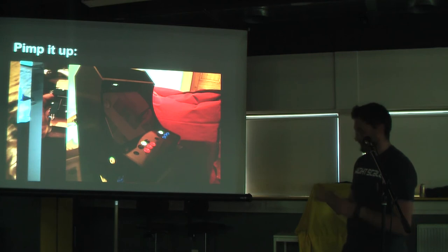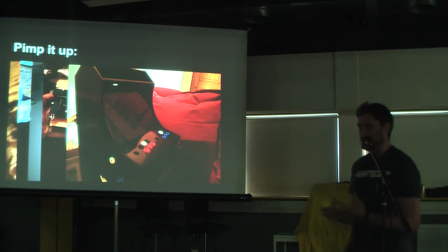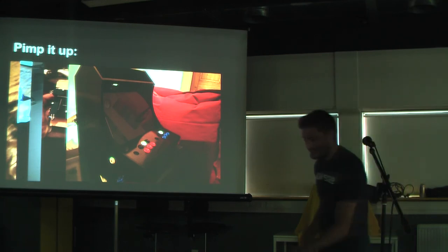I had a screen that I got off, thank you, I think, I hope, I don't know. That was Matt, and it made me realize one of the details that we all liked about the arcade was a screen. Obviously, if I had space in the machine, I would use, you know, an old CRT, but a way to get around that feeling of the main screen was actually to get a sheet of plexiglass, cut it, and just put it in front of it, and you added extra glossiness, and it just made, honestly, a big difference.